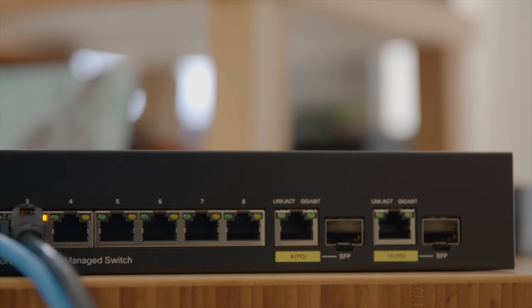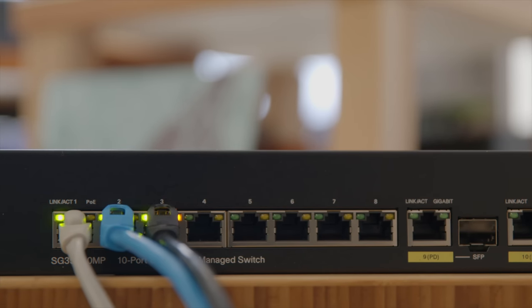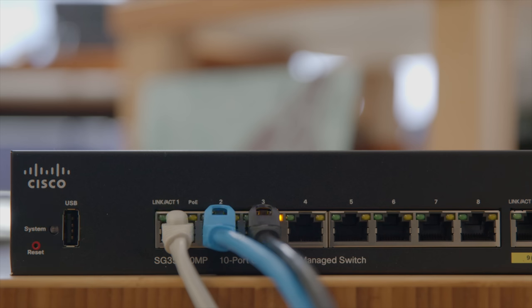Second question: is it expensive? As discussed, no — you can use standard ethernet gear, just a regular gigabit switch plus Cat6 cabling, all off the shelf. That said, the Dante devices themselves are professional gear; there are no consumer-based Dante devices yet. One potential gotcha: the switch must not have a technology called green ethernet, which saves power when not in use but can mess with the clock sync. You either need to be able to turn that feature off on your switch or have a switch without green ethernet.